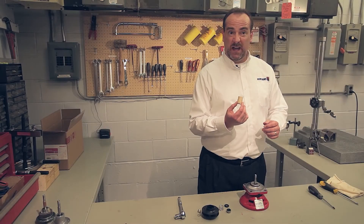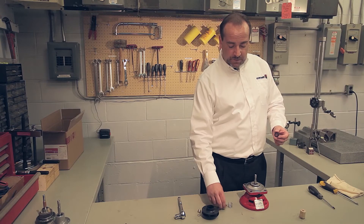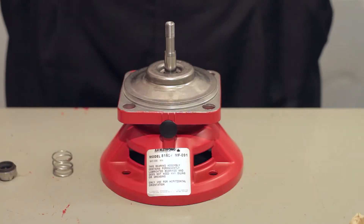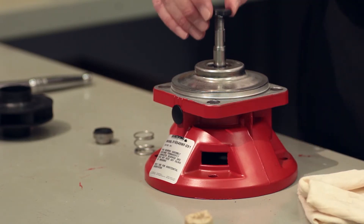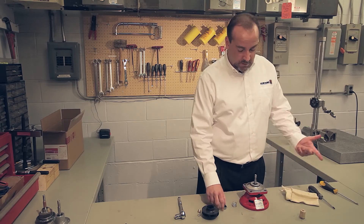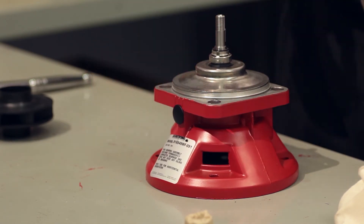When the new seal bearing assembly arrives, gently unwrap it and discard the wax paper. The components include the seal — stationary, rotating, and the spring for loading. It's really important not to touch the seal-face surfaces with your bare hands. Using a clean rag, insert the seal cup into the bearing assembly housing with a suitable lubricant, then press the stationary side of the seal in. Next, take the rotating element and slide it over the shaft — some lubricant may be necessary — and add the spring.